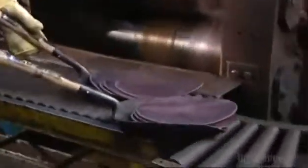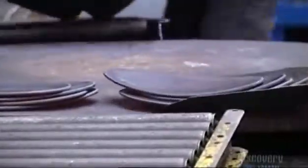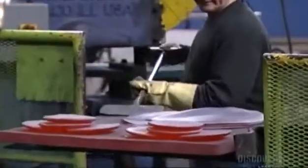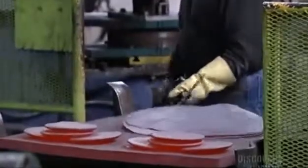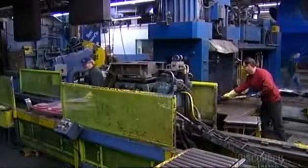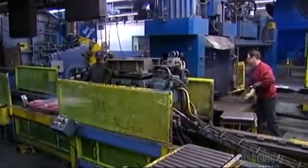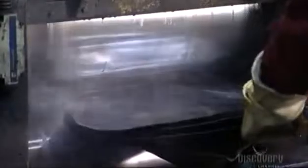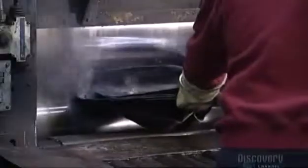These castings go through a heating and rolling cycle up to 12 times, depending on the type of cymbal being made. The repeated heating and cross-rolling creates a dense, interlocking weave in the granular structure of the alloy. It'll make the cymbals strong enough to take a real beating. The interlocking weave will also help transmit sound waves more rapidly across the cymbal.